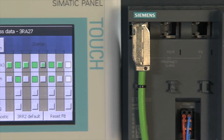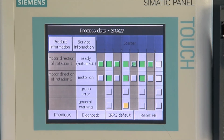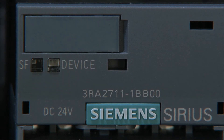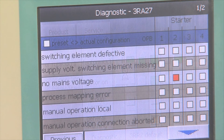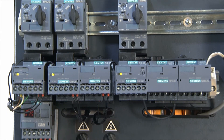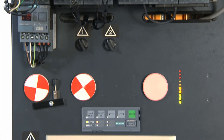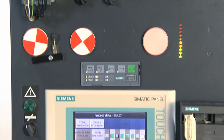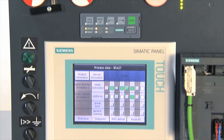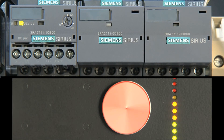For example, the actual voltage in the main circuit is monitored. An alarm is released if the main voltage is not applied. Any programming errors such as simultaneous clockwise and counter-clockwise rotation for the reversing starter are prevented and signaled by the function modules. The time sequences required for controlling Y-delta starters, as well as electrical interlocking of the contactors in relation to each other, are implemented directly by the function modules.